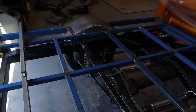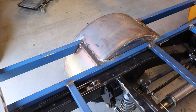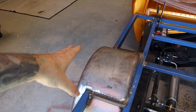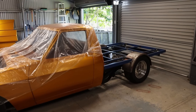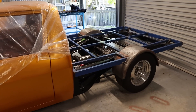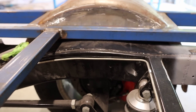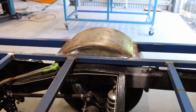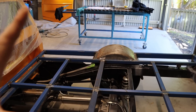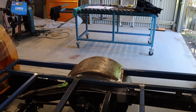I've also filled in these side sections here — I ended up just using 1.2mm cold rolled steel. I'm pretty sure the guards are 2mm but I just used 1.2mm on the sides. She's a pretty low profile tray, which is what I was going for. It sits really close to the chassis — there's not much of a gap there. Hopefully it won't rattle; I tried pushing it down and couldn't get it to hit the chassis. If it does rattle I'll just put some foam tape on the underside of that frame to stop it.